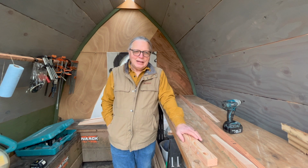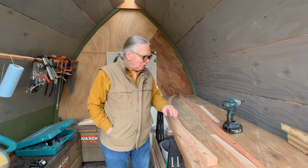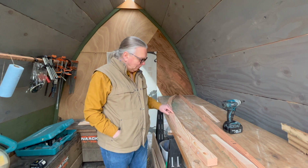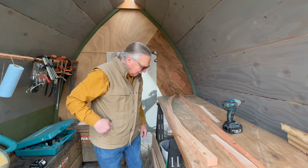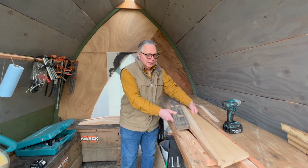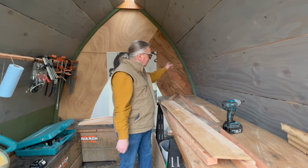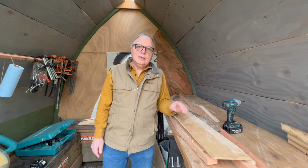And so as I'm learning how to do that, I hope that you'll start to learn how to build arches using triangle scarf joints. In the next video, what I'm going to show you is how to build the jig that I used. This is a simple one that I used to cut these. And as you can see, it's a small thing, so it's easy to work with.